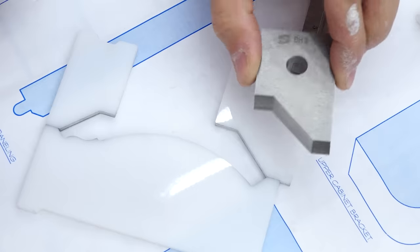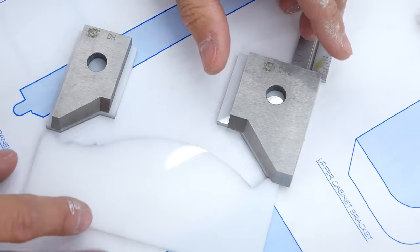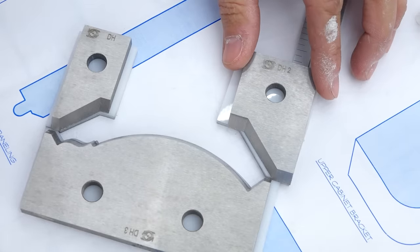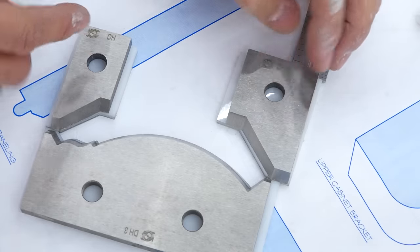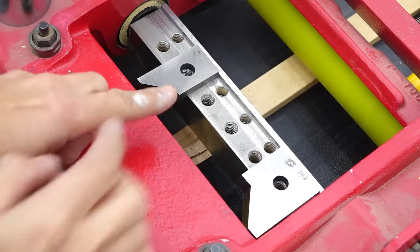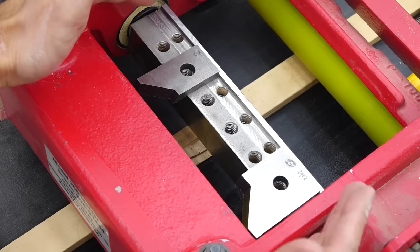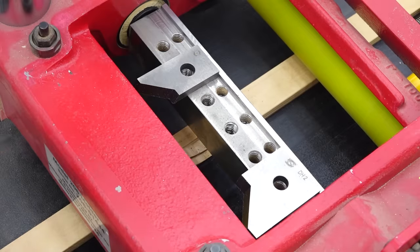So we'll have two different cuts here for the back, and this is something I wish was a little bit different. So the machine we're gonna use has these index holes on the cutter head, and that allows you to index all of the cutters in the head. They're at 1-inch spacing. What would be kind of nice would be if they made these back cutting knives so that the holes index perfectly to the width that we're going for. So with the knife sitting in there, I think you can see that if these holes actually made it so that these ended up 4 1/4 apart and perfectly matched for the back cut, that would be a little bit nicer. I can just run my whole piece backside and the face side and be done.